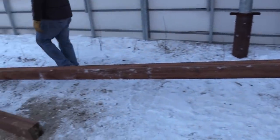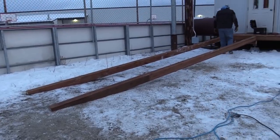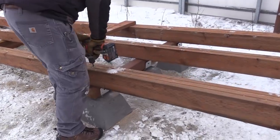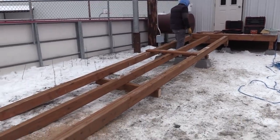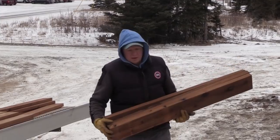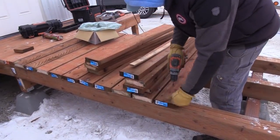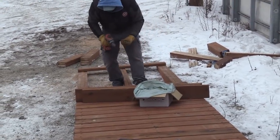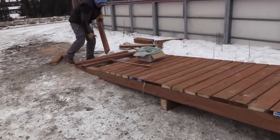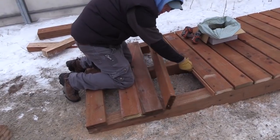First thing I'm going to do is lay out my beams and add them to the existing deck. I couldn't find beams long enough for a ramp that's 26 feet long, so I wound up laminating some two-by-sixes together, gluing them — and now those are the actual beams that support the ramp. Once those are attached to the deck, we'll go ahead and add decking on top, which is two-by-six material, matching the same pattern as the existing deck.